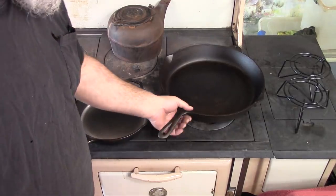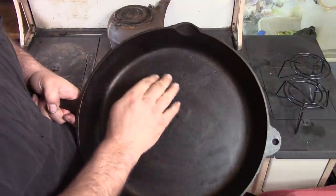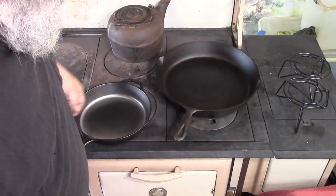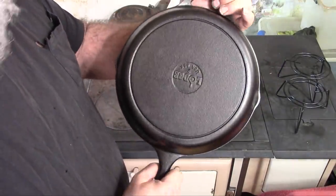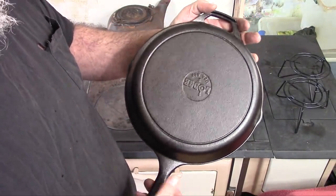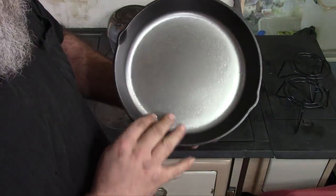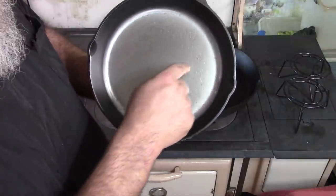Here we are the next day. It occurred to me that this might not have been the best demonstration of smoothing up cast iron because I have to leave so much of the old pitting in there — you're really not going to get that out without taking out tons and tons of metal. Since most people ask me about smoothing up Lodge cast iron, I have here a number 8 Lodge, a pretty new one, the current style of production. This is what you get if you go to the store right now and buy yourself a number 8 Lodge skillet. I smoothed that up — I didn't take the seasoning off, I just sanded it out. This is about 45 minutes worth of work.